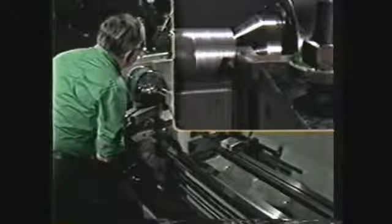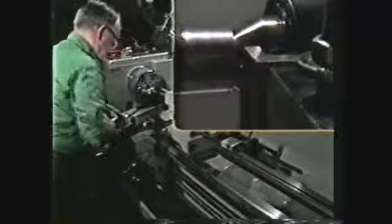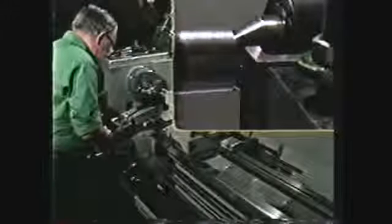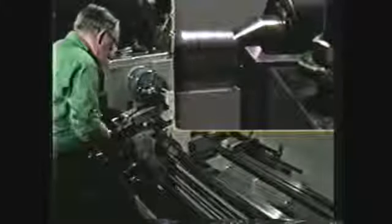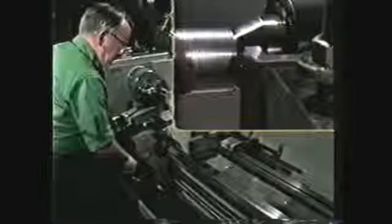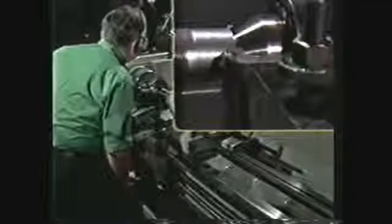Using the crossfeed and carriage hand wheels, bring the tool to the end of the work and pick up a cut. Then, using the carriage, move the tool off the end of the work. Set the compound dial to 0 and the crossfeed dial to 0. Take a 5/1000ths depth of cut on the compound and engage the half nut. Since we are machining an even number of threads, the half nut can be engaged at any line on the thread chasing dial. Take a scratch cut on the tapered portion of the pipe.